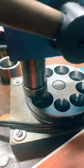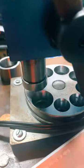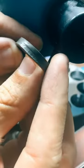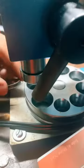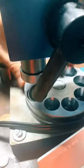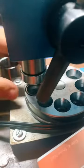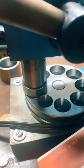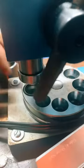With these, you can see that under the date, it gets a little wiggly, and to correct that, what I'll do is reduce and stretch it a couple times. So we're just going to go back and forth and kind of work that wave out. It's getting a little bit better. We'll go ahead and stretch it again and then reduce it one more time.